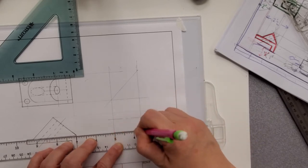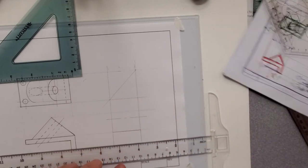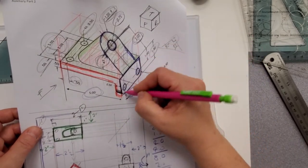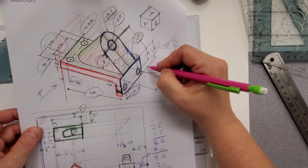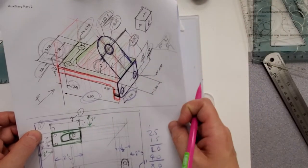We know this is a solid line. See how I did that? We know the bottom of the object is here, but we also know that the corners are radius corners. They share the same center as these holes here. And that's half inch above because it's half inch from the top, which means a half inch from the bottom because the total front is 1.5.